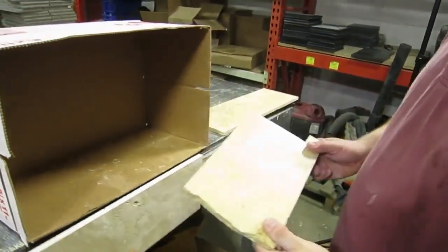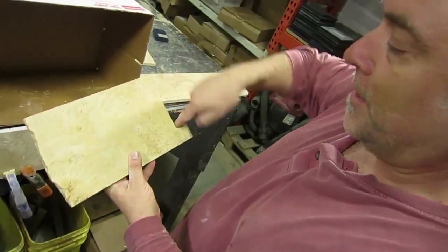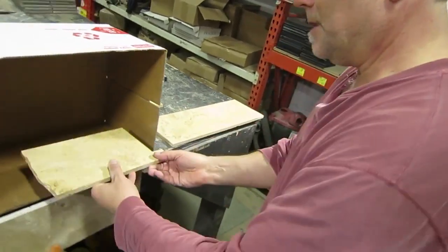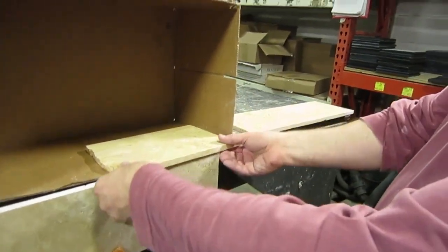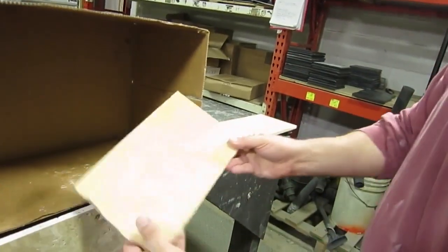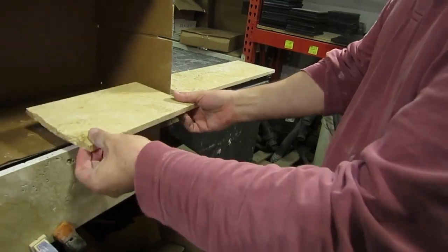I'll be making some sort of a shelf. You'll probably be doing the final notching here depending on that, and making that final trim to line this up with the corner of the wall. You have a lot of different options in terms of where we want to put it. At this point I'm thinking we'll want it to overhang by about three quarters of an inch to an inch, so I'm going to make a certain cut here, but you'll be able to change and adjust it on the job site.